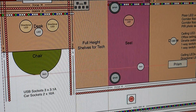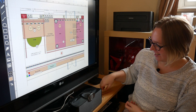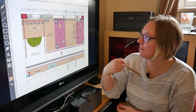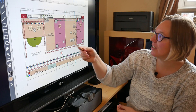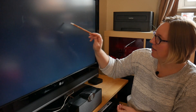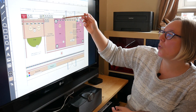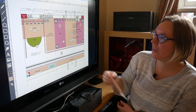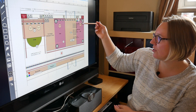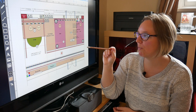This is one of the diagrams I did when putting the lighting together, which again was a process that just seemed to take forever and be very involved. I took my narrowboat layout diagram, split it into different sections of rooms, and started drawing in things like plugs, junctions, little USB sockets, switches. There's some LED strip there, and those are actually wall lights — I wasn't sure whether I was going to have them on the ceiling or the wall at the time. There were loads of lighting options in the office. I did this for every room on the boat and wrote a little list of everything, so I could go back and refer to it when putting my spreadsheet together.